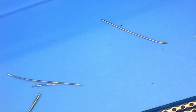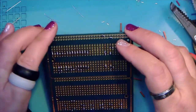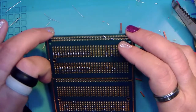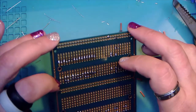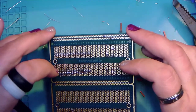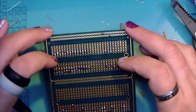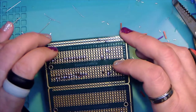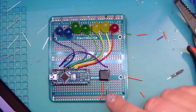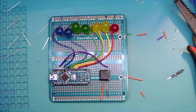And so now I'm going to flip back over to the wide angle. And I'm just kind of letting the board hit the light at different angles. It makes it a little easier to see if I've accidentally bridged anything or anything that looks like it might need a little more solder or reflowed. So not great, not terrible, should be serviceable. So, okay, there's our project. And wow, I started late and I still have a couple minutes to spare, so yay. So that's our project.